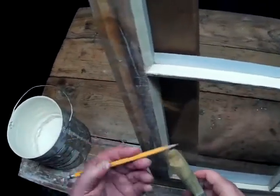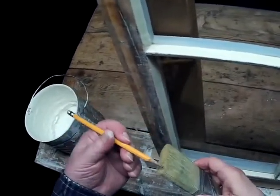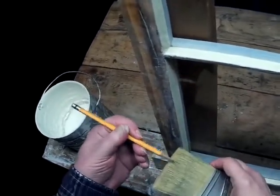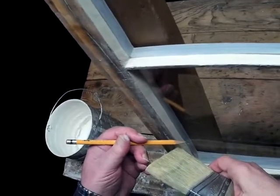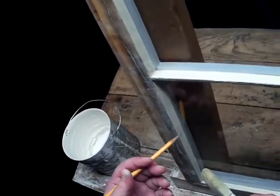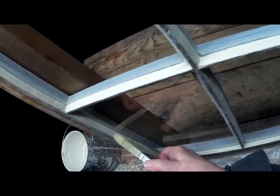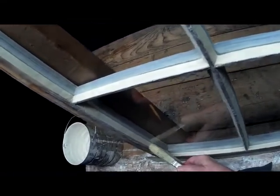And another advantage is that where this surface is 90 degrees to this surface, it shows a row of bristles, right? This outer row of bristles. And you can see there's a few stray bristles, there always are on a paintbrush, that stick out. So as I bring the end of the bristles onto the putty, the angle formed by the glass and the putty tends to hold those bristles right in alignment along the edge of the glass, like that. So we'll see how that works.